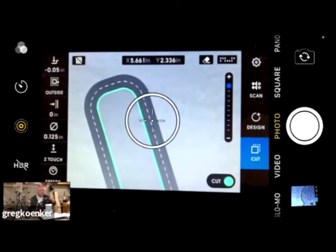Now it's telling me how to cut it on the outside of the piece. So if I was cutting that piece out for some reason, a plug to fit into a knot in one of my boards that I want to conceal a little bit, I could cut that out, then cut a mortise over that knot and put that in as an inlay. So it would hopefully draw very little attention. So that's two of the ways you can do it, inside and outside cuts.